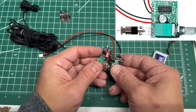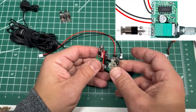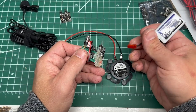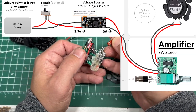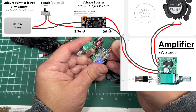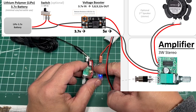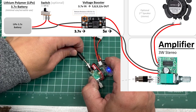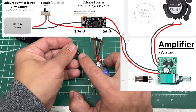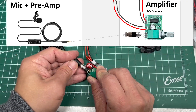I put hot glue on it to hold it in place so I can use this as a single unit and mount it on a surface. That necessitates my 3.7 volt power coming in here. So now we plug in our speaker. I follow my red markings and align those — I've got two channels out. This is actually a TRRS cable but it still works fine with this TRS connector.